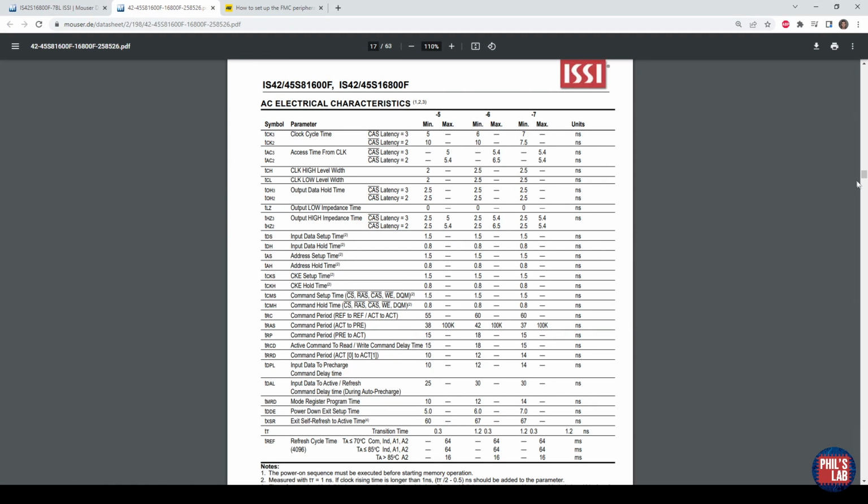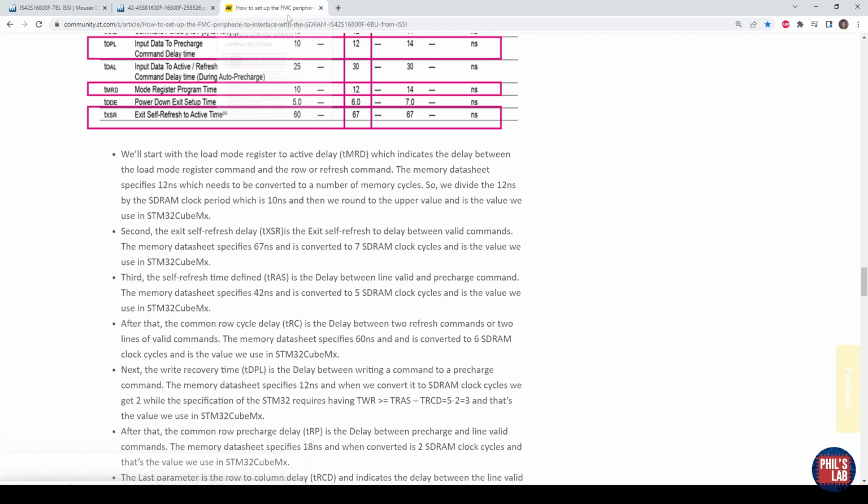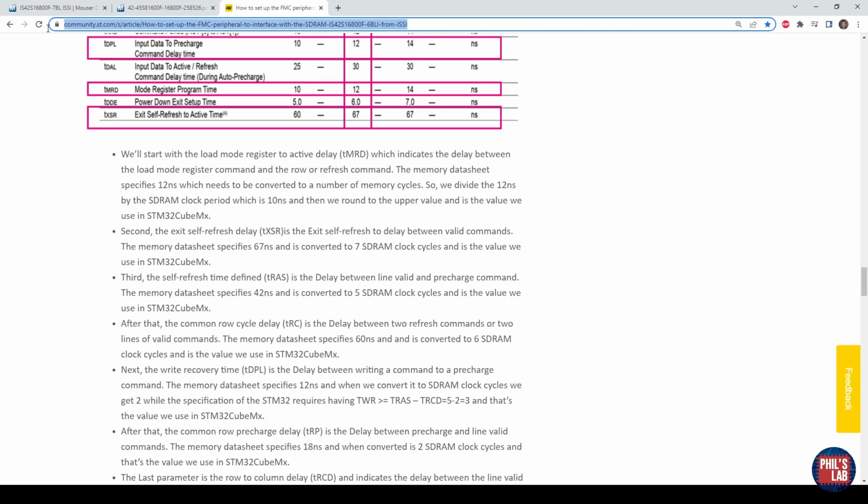We can get this information by looking at the datasheet at the AC electrical characteristics, and we have a lot of these timing values. And depending on the speed grade and so forth you use, you'll have to enter these in. I won't be going through this in detail in the video because the calculations are a bit annoying and a bit long and tedious, but I'll leave a link to this article by ST in the description below, and this is exactly what I used to then calculate these values.